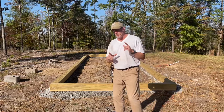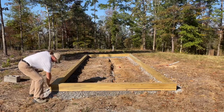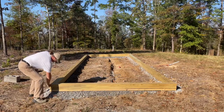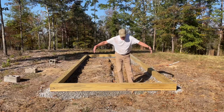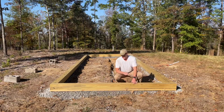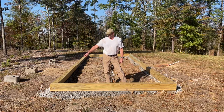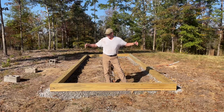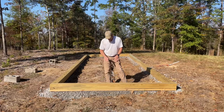Planta tells you in a conversation that you can be off a little — but not on the width. As the greenhouse comes down, it's going to lip right here and actually overlap on each side, and the door will mount here. So what I wanted to make sure was that I didn't cut the beam short. I wanted an exact precise cut on the six-by-six. This is a 12-foot six-by-six that I cut down to 10 feet. You can't take a little bit of variance with that, so I used a skill saw and then a hand saw — probably overkill, but making sure it was exactly where it needed to be on the front and the back.